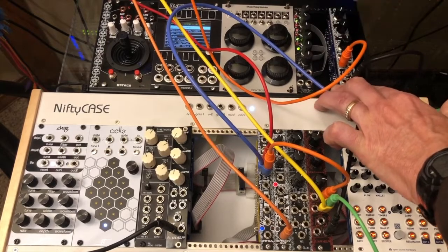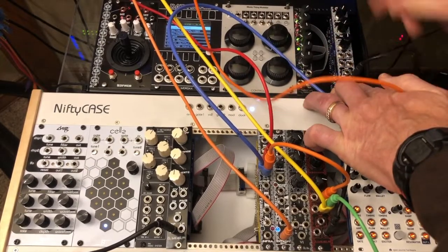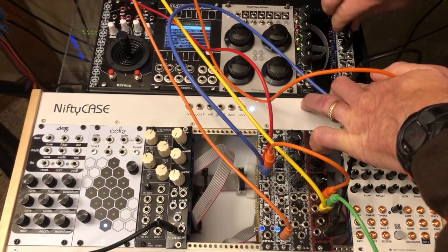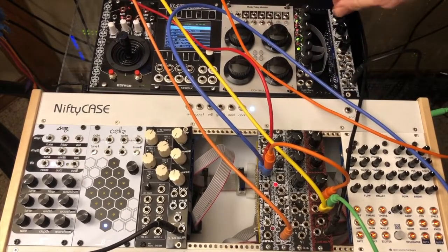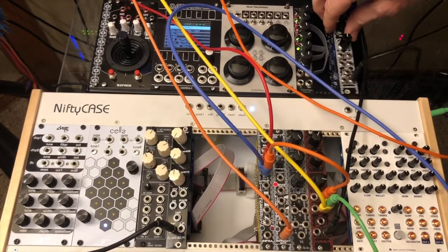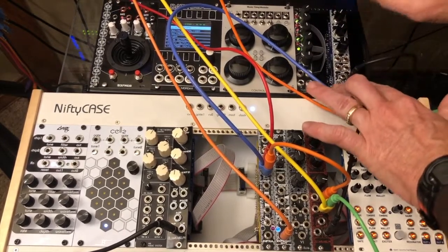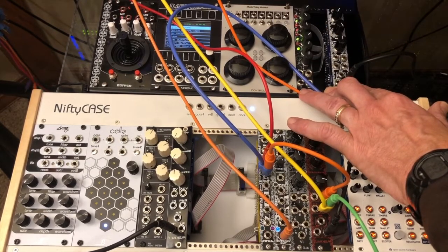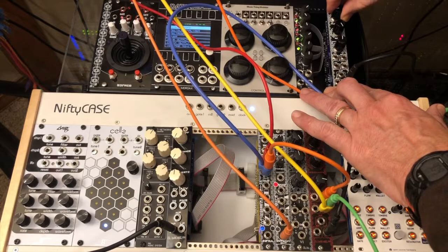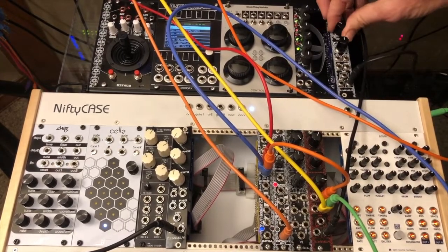Let's try that at, oh, so interesting about self-oscillation. If you open the cutoff all the way, sometimes, depending on the power supply of the case, that won't go into self-oscillation. So a more reliable way of getting it to self-oscillate, if you're having trouble, if that doesn't work on yours, is to have this closed, put resonance fully up, and then you can get a self-oscillation. All right.